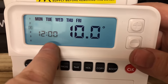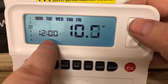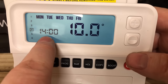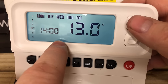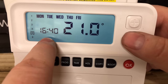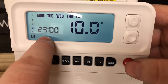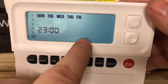Then we can set the back temperature to whatever we want. For your next setting, if you want it to come on at dinner time, set the temperature you want — you don't have to set this one if you didn't want to — then click OK. Again at two o'clock it'll go off, put that back to 15 so the house doesn't drop below 15. Then once it's come back on at four o'clock, click OK — we're asking it to be 21 degrees. If you want it to go off at 11, click OK and set the back temperature to 15 or whatever you want, then click OK.